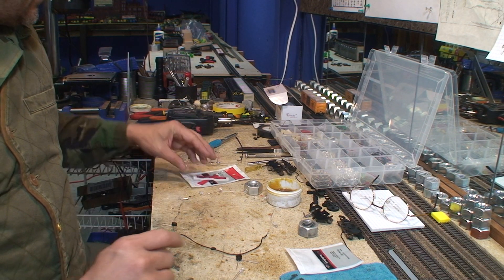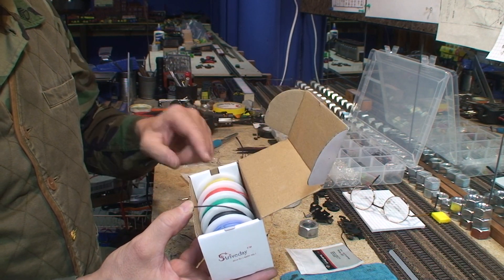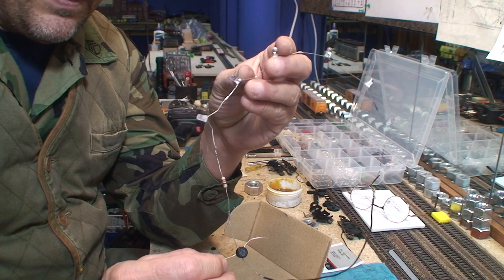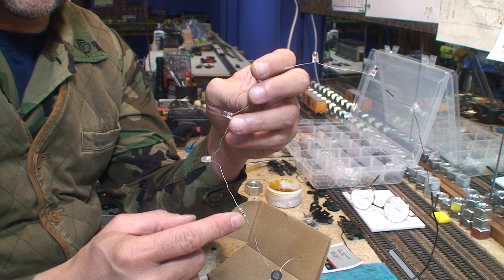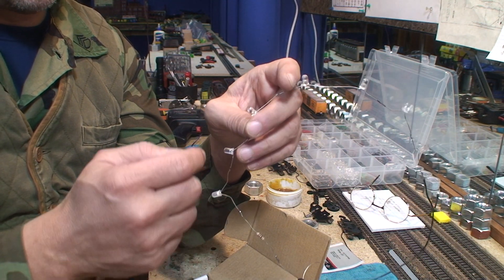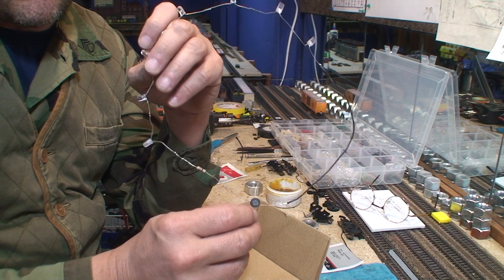I'm going to use, again, this Strive Day 30 gauge wiring that I love. Since I've got two colors I don't use — yellow and blue — those are the colors I'm going to use for this. In the loop, power comes into the rectifier, heads out to the resistor, around the loop, and back. So I'm going to go rectifier, resistor, then yellow wire and LEDs all the way around. And when I get to the final one, I'm going to switch that last wire — I'm going to make that last one the blue one that comes back to the rectifier.